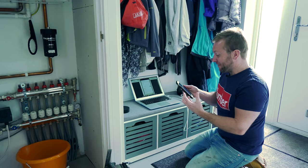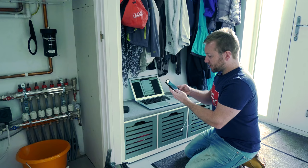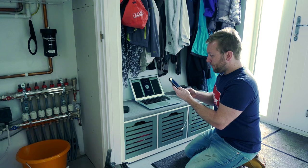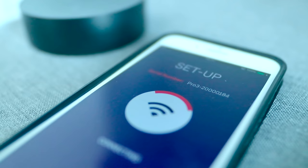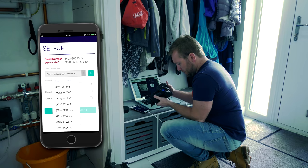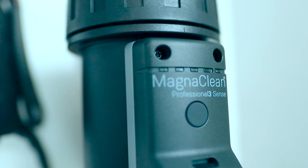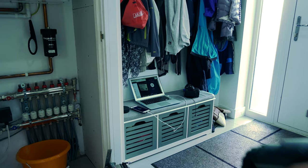This is the bit I really love. We're going to give this filter a name — I'm going to call it Mark and Charlie's system. It's got everything in there. If I want to change any of these bits, I can. Next — Mark and Charlie's filter is now scanning for Wi-Fi networks. Once you've found the network you want to connect to, it's got a percentage rating of the strength of the network signal, which I wish phones had anyway. It's important to take a reading of the Wi-Fi strength from the position where you intend to install the MagnaClean Pro 3. Pop the password in from your customer, connect the MagnaClean Pro 3 to the local wireless network, and as soon as there's a successful connection, the MagnaClean will auto reconnect your phone to the local wireless network.